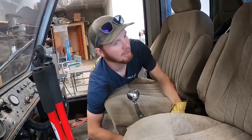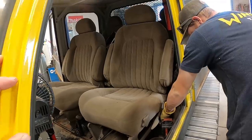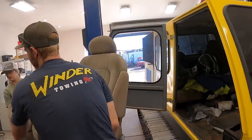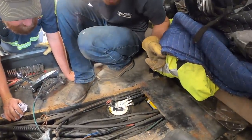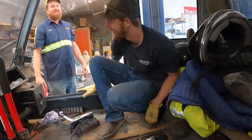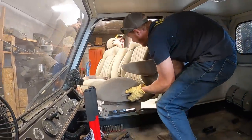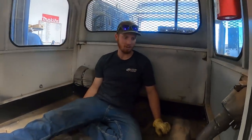How do you get into the back seat of this? This is heavy. Okay, so where is that gas leaking from? Where's the fuel pump? That hose is ruptured. That's not a high pressure hose. Okay. Hand me all that stuff out of there. We gotta pull the back seat out. We gotta replace that hose. Are these seats extra heavy? It feels like a giant refrigerator.